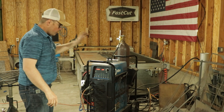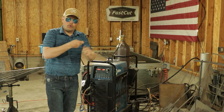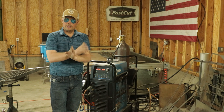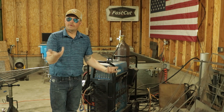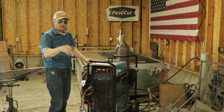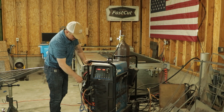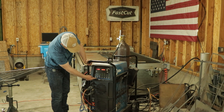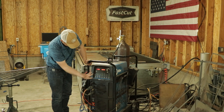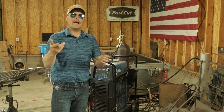Before we get into this video, which I'm really excited about — we're going to be talking about the Dynasty 400 — I've got to clarify one thing. At the beginning of the video, I have the leads reversed on this machine. One of the reasons being is when you TIG weld off of a Pro 400 or an engine drive machine, you swap your leads to TIG weld with. I did that, went old school. Well, this machine is a lot smarter than I am — it actually will do it for you. Once you hook up your stinger in the top and your ground in the bottom, you hit the process button, select AC or DC, then bump through to TIG high frequency, TIG lift arc, or stick — and it automatically does it for you. So just keep that in mind: at the beginning of the video the leads are swapped, but through the video we swap them back and we're rocking and rolling.